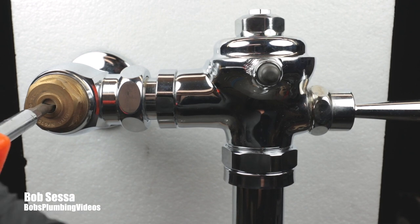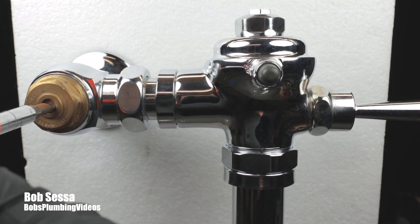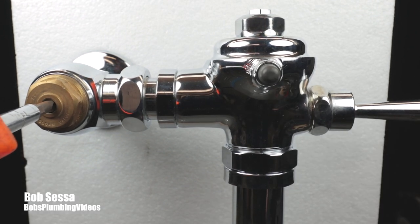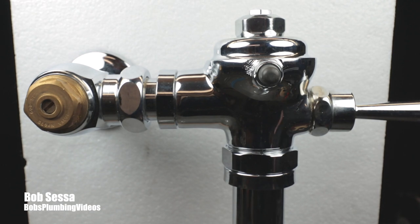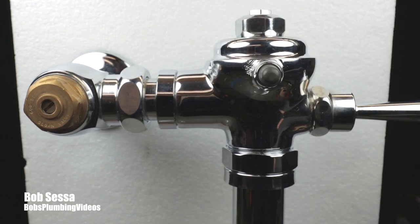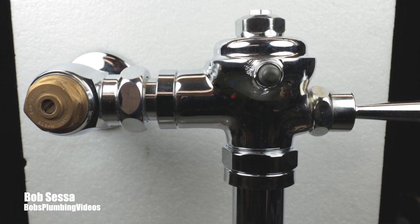It's going to start to let the water in and it'll start to flush, and it may run until you have it open all the way. You're going to need full pressure in order for the water to work its way through the bypass up into the upper chamber, so until you get this open all the way it'll probably continue to run. Even after you get it open all the way, it may continue to run. If you're in a multifamily building with people using water all the time, there are fluctuations in water pressure, so you may have to stand there a minute or so before it completely shuts off. I've been in situations where I've been standing there for five minutes. In my next video, I'm going to go over every component and how you may adjust the screw in here if you find that it won't stop running.